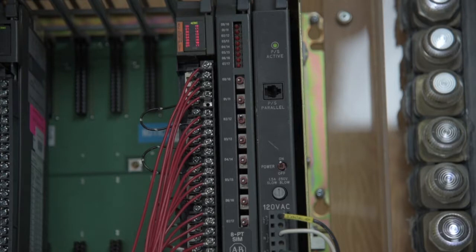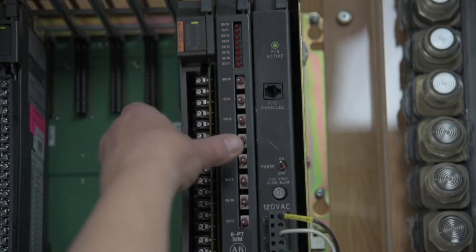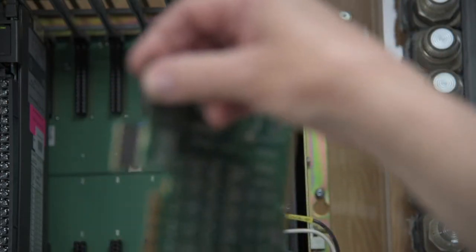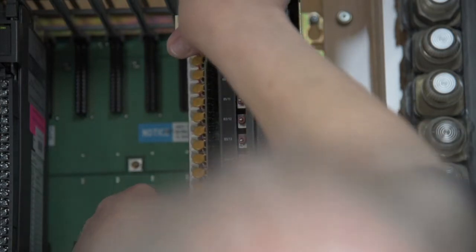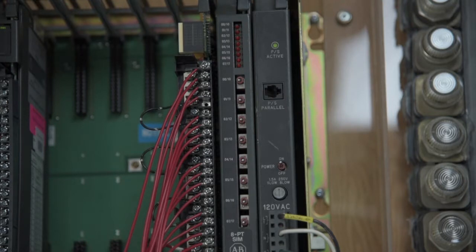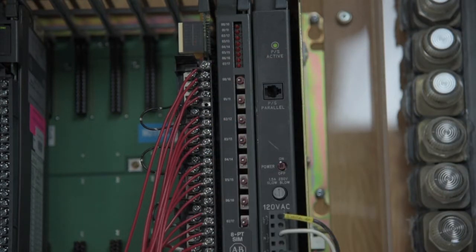Now what I'm going to do is take the OD16 card, turn it off, stop it from flashing. Power is off. Pull the card out, and I'm going to put in our ODD card. And I pulled the fuse here just so that we can do this, to show that power on. And you can see with power on that our blown fuse indicator there is on.